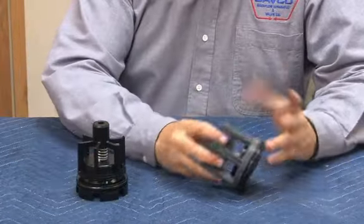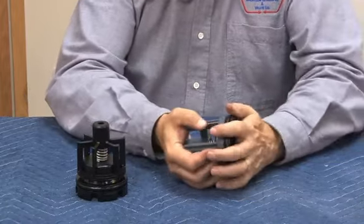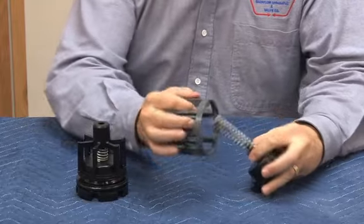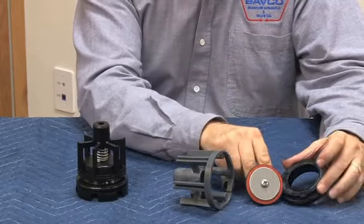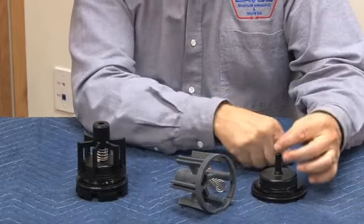First check is a little different, so I want to take a look at it besides having a different retainer on the back side. Same 8th turn rotation will release the spring tension for the average repair. Spring retainer, spring, disc holder and seat. One screw holds the disc in the disc holder, symmetrical disc again. Reassembly is going to be the reverse, and then the one piece is the spacer.